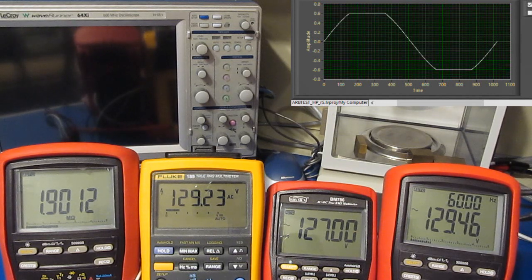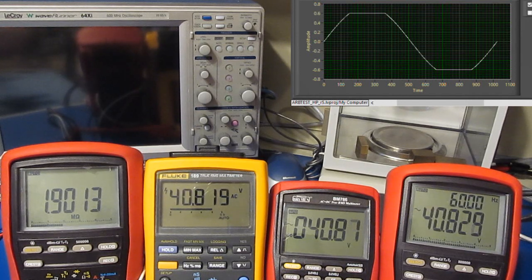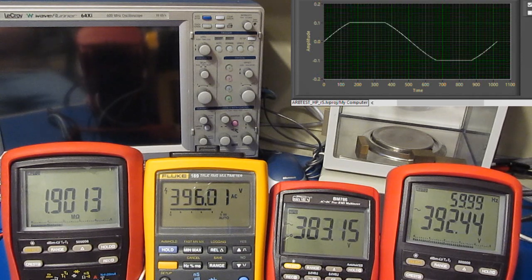I can guarantee you if I had, you know, long probes hanging out loose on the table and we set up the meter to, I don't know, read voltage or something, of course it's going to fluctuate. If we were trying to read resistance and we had all those long wires out there, yeah, pretty much every meter is going to have a problem with that.